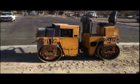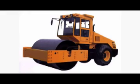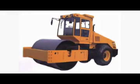Smooth drum compactors come in two main types, dual and single drum. You may even see a roller with three drums, however these are not commonplace. Smooth drum rollers may employ vibratory forces to aid in the compaction process. Static and impact forces compress the soil.